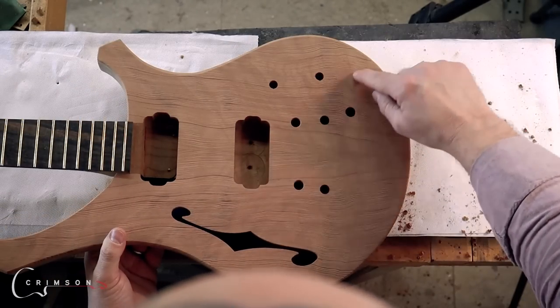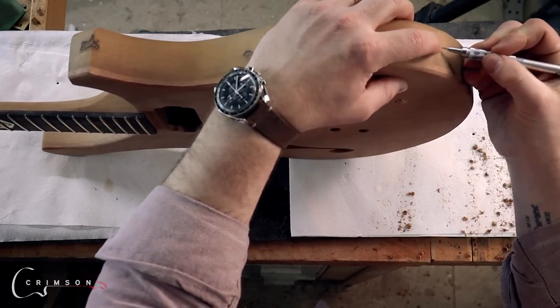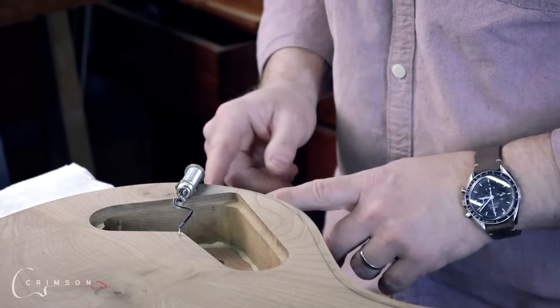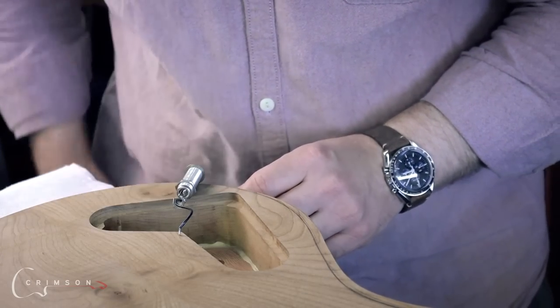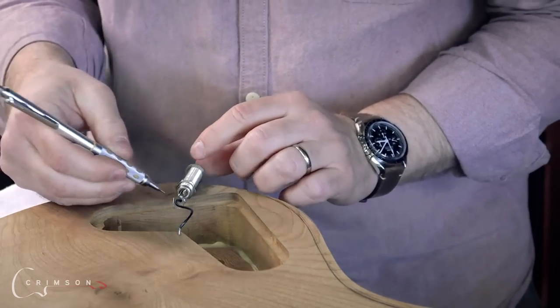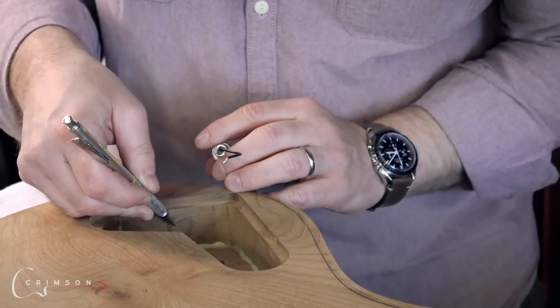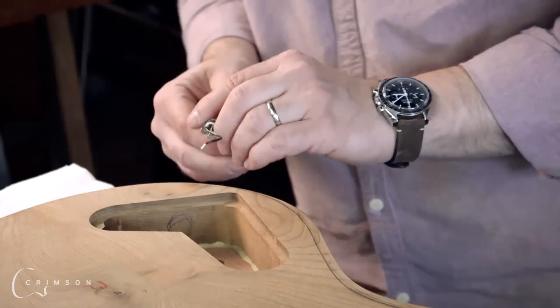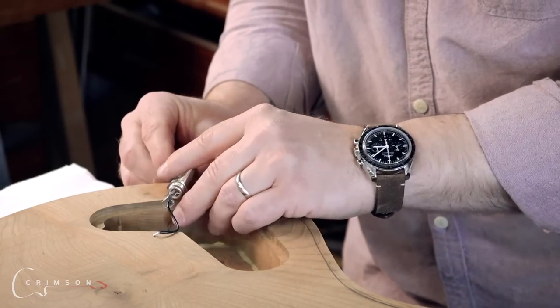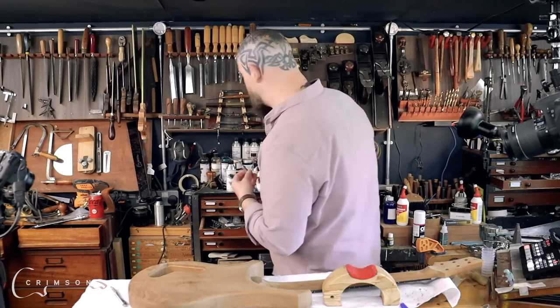Line the jack socket up with that there. We're using a barrel jack because I don't have a brushed standard jack. In that position it only just comes through to here. I could chisel away or gouge away so it makes this side, or recess that deeper into the body so it comes through — or maybe even a combination of both. 12mm hole it is.